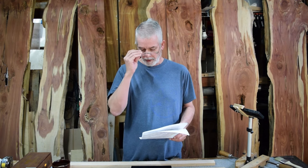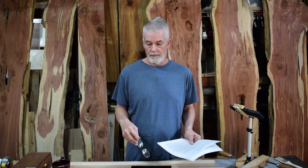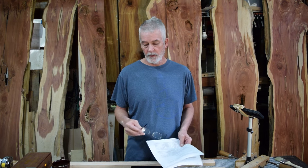Needed to be reminded of that, and you pointed me in a good direction. Not only is it different, it's ridiculously high. Most circuits — preamps, amps, pedals — magnetic pickup guitars want to see about one meg ohm impedance on the input, where the piezo would like to see five to ten, even twenty meg ohm, which is so much higher. The circuits are a little different. It all leads back to buffers, buffers and preamps — that's been the same thing for smoky amp, ruby amp, any small 386 amp, guitar pedals.